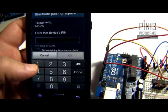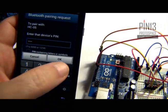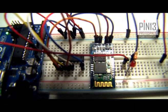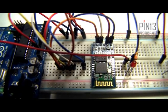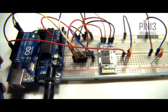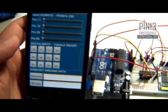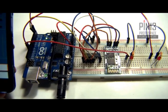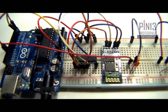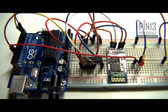This is done only once during pairing. The default passcode for the HC05 — which you can change, and you can also change the name — is 1, 2, 3, 4. Now watch the light: it used to blink continuously, now it just blinks twice every one second or so. We now have a connection between Androino and the HC05 Bluetooth module. The double blinks every second confirm that the pairing and connection have been made successfully.